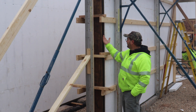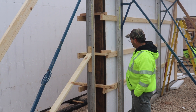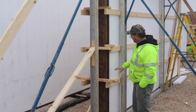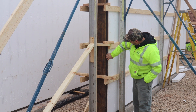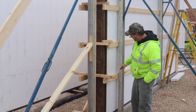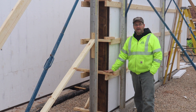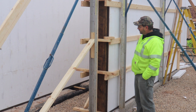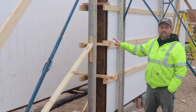This is a shutoff or front end of the wall at the end of a stairwell in a basement. We're doing what's called hog stropping: a plastic shutoff holds the poly panel in place, then you snap up a board and run 2x4s past, turning a 2x4 down on edge. This alone provides a lot of strength, and the extra kickers provide maximum strength.